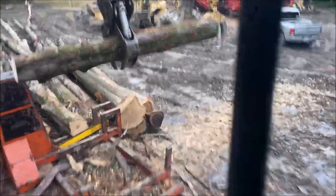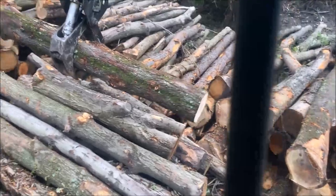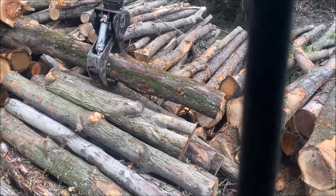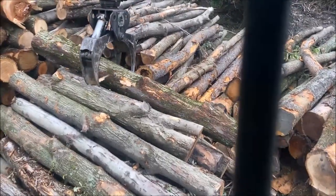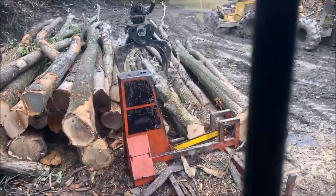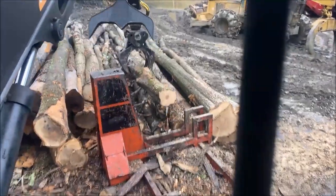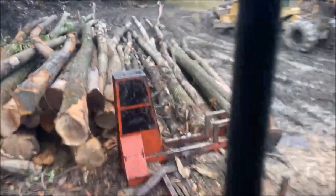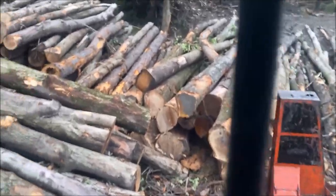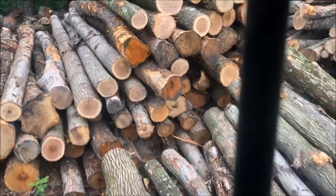Now, whereas if this was going to a sawmill, like you were contract cutting for a sawmill, and all the logs were going to one place, they would want that 12 foot. You do that, you're going for footage. So whatever you can cut with the least amount of deductions once it gets scaled is what you'd want to cut as the logger. And this will all be straight scrag wood. I got some nubbins to cut off there, I'll cut them off later.